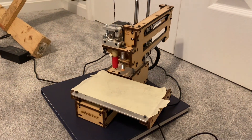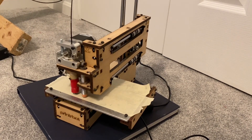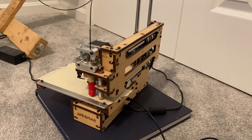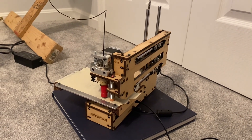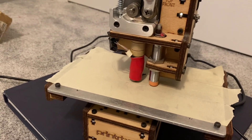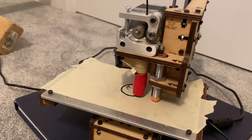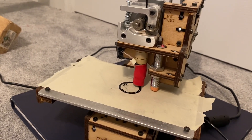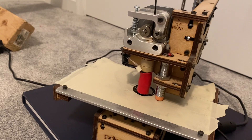You're going to see the first thing the printer is going to do is measure the build surface in three different spots. That makes sure that it's going to account for any surface irregularity. And now it should be warming up. The first thing it's going to do is print a skirt — maybe a little junk came off the print head — just to get the filament flowing and coming out nicely. And now you see the little gap in between that perimeter — that's the brim, that piece I showed you, that's going to help stick the part down.